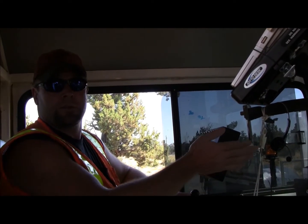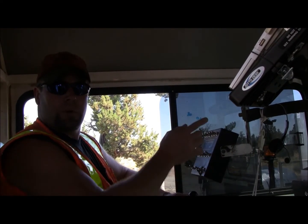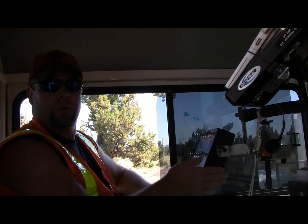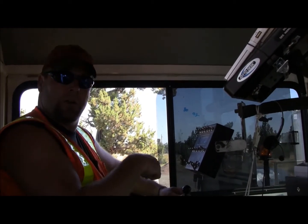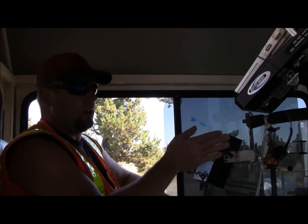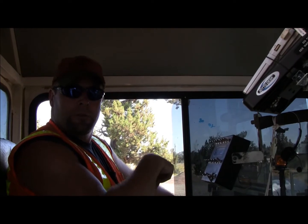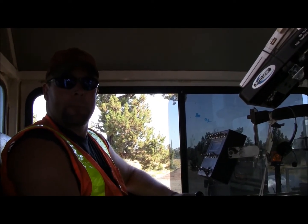Going around corners, it's the same way. I have to compensate the laser to the upper left side of the line on a right-hand turn, so I can just watch my laser instead of being right down here below me. I can just keep my laser on the upper right-hand side of that line all the way around the corner, and I know that my paint's going to be on my line following it by being ahead.